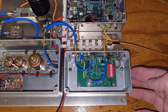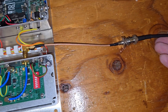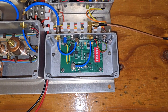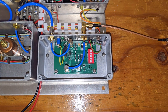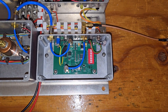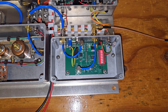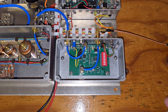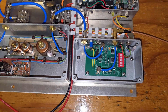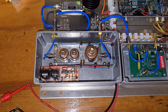Down here is the DigiLO signal source, which generates a signal at 1152 MHz, currently locked to 10 MHz coming in from my Trimble Thunderbolt GPS disciplined oscillator. As mentioned in a previous video, I might use a programmable GPS DO Leo Bodnar unit that can generate a signal 299 Hz higher than 10 MHz, to get a cleaner signal in the area of the 10 GHz band where I want it. Right now the DigiLO is set to generate exactly 1152.000 MHz, which after going through the multipliers comes out at 10,368.000 MHz — close but about 300 kHz away from where I want it.